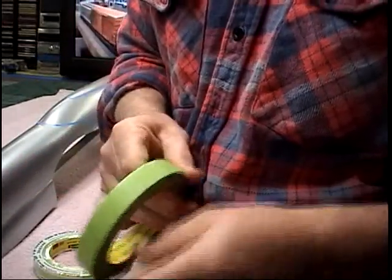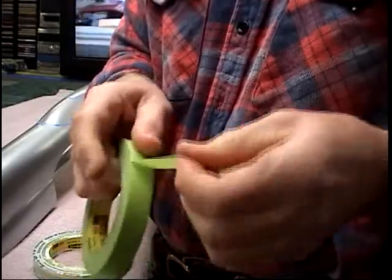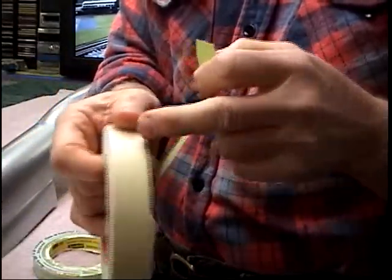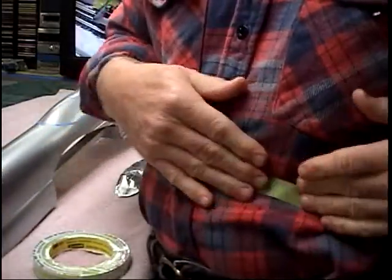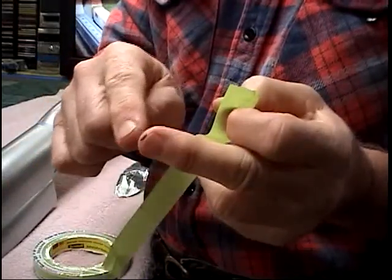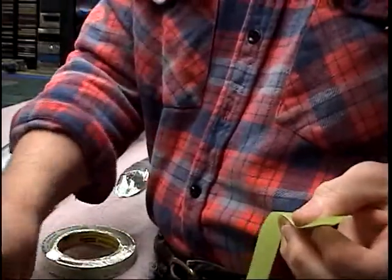Here's another thing with tape: if you put tape away for a year and it's in a damp area or somewhere that gets hot and cold repeatedly, the tackiness factor can change. It usually actually gets more sticky, not less. The green tape has always been a good balance - not as tacky as the paint-puller. The trick is to strip this down into eighth-inch strips and do the edge of your trim with the really sticky tape, then use the less sticky or drafting tape as the back-fill.